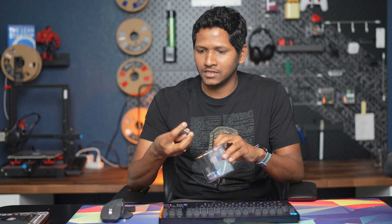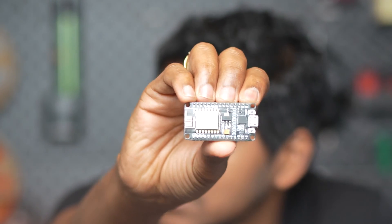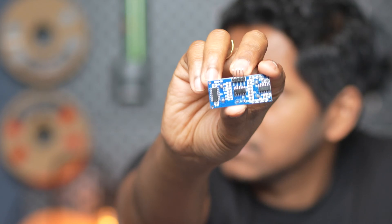The hardware we need is an ESP8266 board — this is a microcontroller we can use to connect to Home Assistant. We also need an ultrasonic sensor, which is a distance sensor that calculates the distance between the sensor and an object in front of it. We need jumper cables to avoid soldering, or you can solder them if you prefer. Finally, a micro USB cable is needed to load the software and power the board — make sure the USB cable supports data transfer.